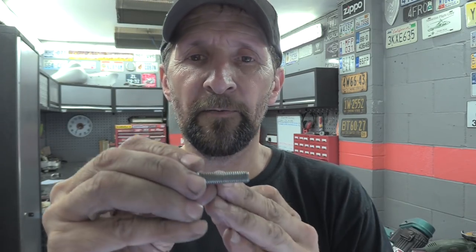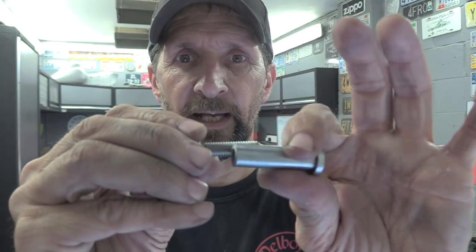Screws in — that's stainless, so I'm going to thread-lock it in. Stainless parts like to rattle apart, so I'll put a little tiny bit of blue temporary thread lock — not the red permanent stuff that was in that arm. Once that's in there, half the thread will go inside there and the other half will go in the arm, and I'll just lock the head off, clean up the end, and then the whole thing will screw in and do its job. Practically done — let's assemble it.